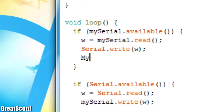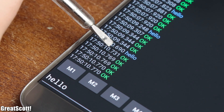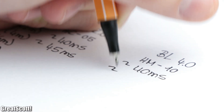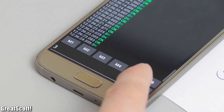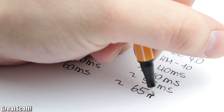For the last test I edited the basic communication sketch so that it sends a response to the phone to measure the time difference between sending and receiving. I then sent data from all around my apartment at different distances and measured the ping for both Bluetooth 2.0 and 4.0, and concluded that both versions work flawlessly no matter the distance and offered a similar ping.